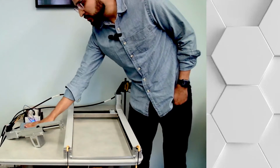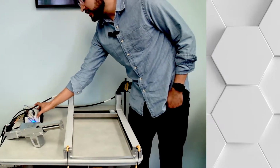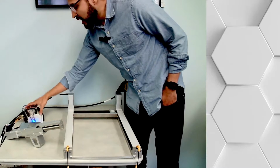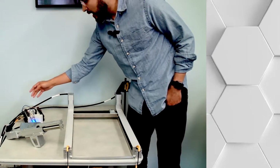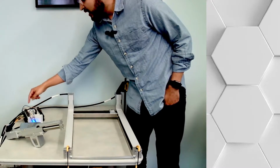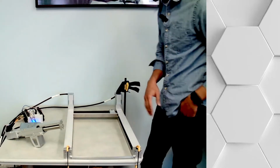I have a power supply, nothing fancy there, just a power supply that I'm using to power up the motors and this motion controller, or this PLC, right? This PLC has the connections for the motors on the side. It's also an EtherCAT master. It has some onboard I/O as well, and I can do other things like RS-232. I can do I/O-Link. I can do a bunch of other stuff. It has two USB ports and whatnot.